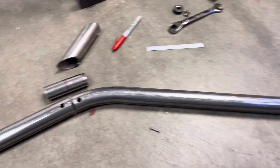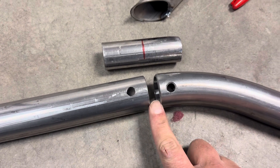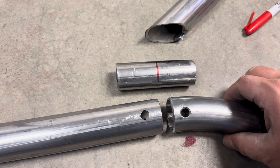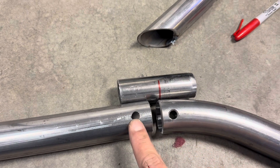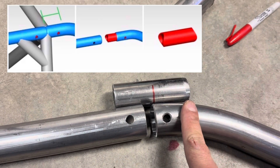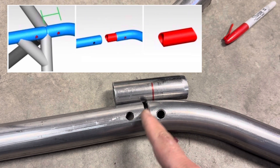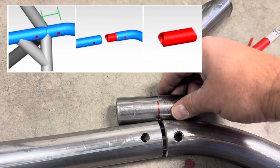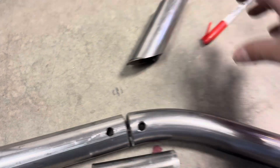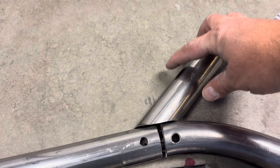I just wanted to show you guys how I'm splicing this tubing. I had to take a couple inches out of this section here, so I cut it. The way I'm going to splice this back together is I beveled these tubes back just a hair. I got a four-inch sleeve that'll go inside of this tube and that tube. I've drilled holes here for rosette welds to connect the sleeve to the outer tubing, and I'll leave a small gap here so I can get a weld all the way around — connecting these two pieces of tubing together as well as the sleeve inside. I purposely chose this spot on the tube because there's another intersecting piece of tube that's going to come in and splice right over the top of that.